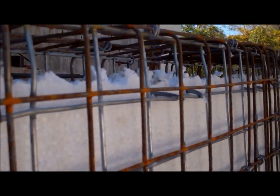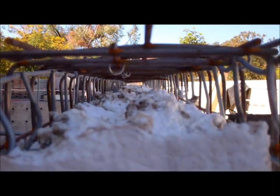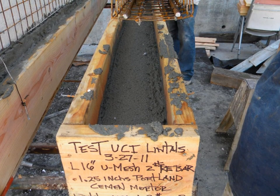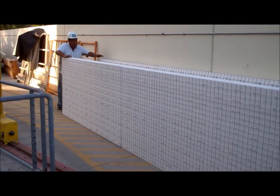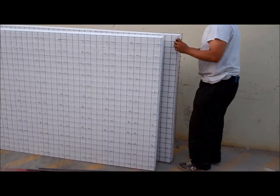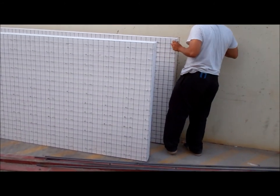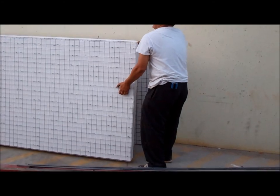I'm going to bring the camera around and show you so you can see down the panel. This will be a small concrete beam. Basically, that's the panel right there, prefabricated. Any length up to 40 feet long, different thicknesses. The panels start at 8 feet in length and go up to 40 feet in length. For two-story houses, we use these types of panels, standing upright over rebar.